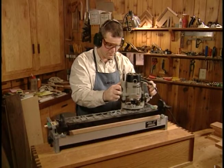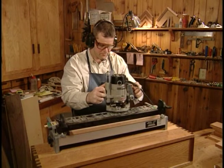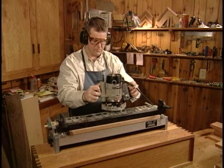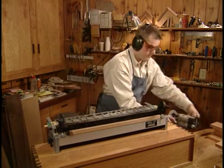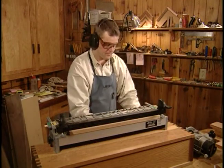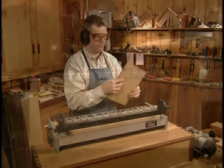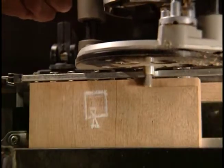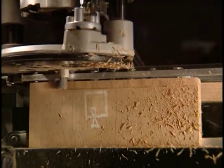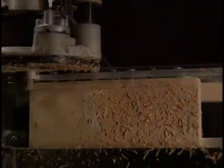Tolerances in board thickness, guide bush diameter, cutter depth, angle, diameter, and concentricity make it impractical to record or chart each setting for sliding tail size. Using trial and error each time, it doesn't take long to learn how to produce a good fit. When the fit is satisfactory, route one end of a project tailboard and test again. If the fit is good, route all the other ends.